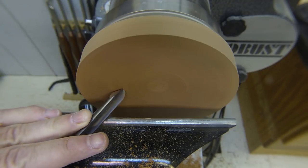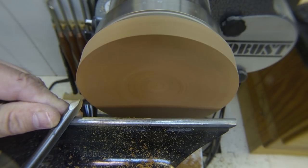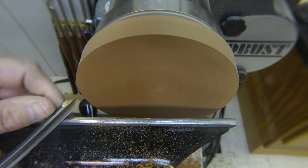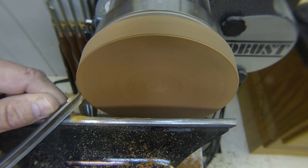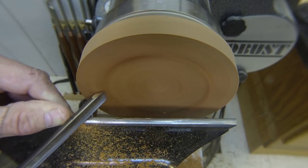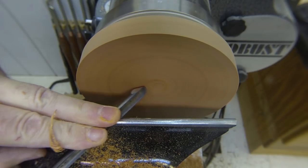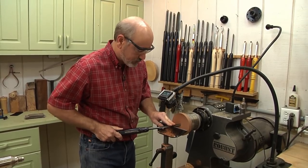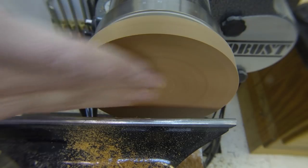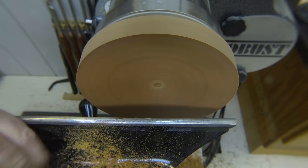Cleaning up the bottom, just taking a little bit of wood off at a time. This is the edge where you can get into trouble, so I'm using my fingers as a backstop with the tool flat and the bevel aiming straight, making a little bitty cut — it makes contact, I can roll the tool now, and it starts cutting. We've done a great shape here, and you don't have to be perfect underneath because this is going to be hidden — it's the bottom of the top of your mushroom. Now I want to drill a hole, then sand, and then we're going to do one more trick.